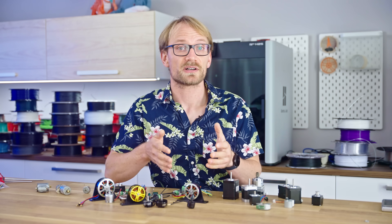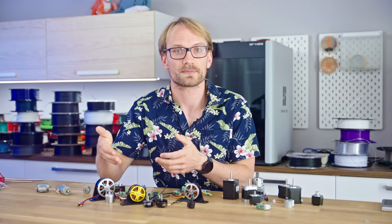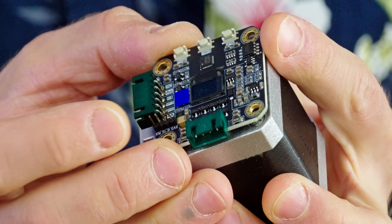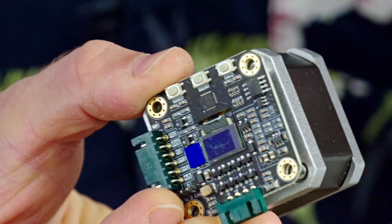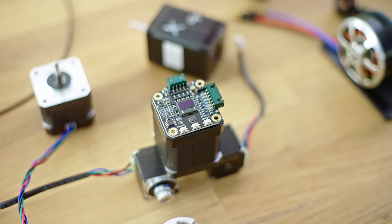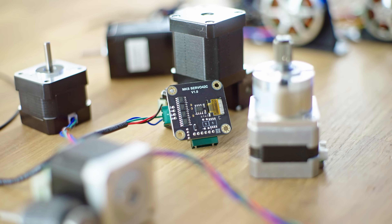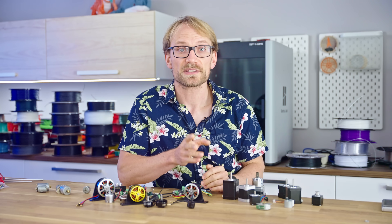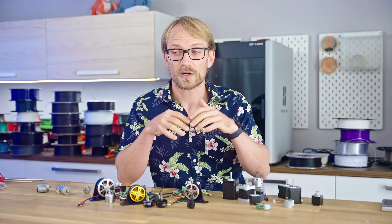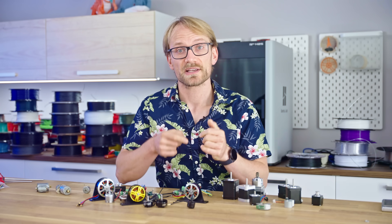SimpleFOC is based on the Arduino runtime and you can actually tie it into your standard step and direction signals. You can even get little bolt-on driver boards that directly sit on a stepper motor and run it in FOC mode, instead of just stepping through pre-calculated amounts of current like a traditional driver. But these ones from MakerBase are running a proprietary firmware that you can't replace, so I wouldn't really recommend them. I assume FOC is also what Bambu uses in the BLDC extruder in their printers. There are a bunch of benefits to the FOC drive mode and also some downsides, and we'll cover those later.